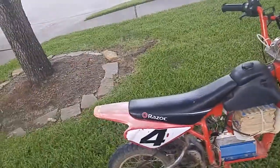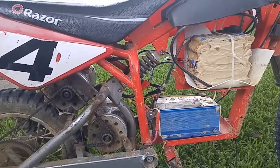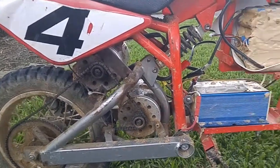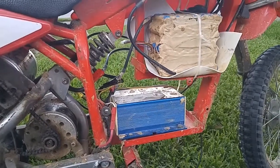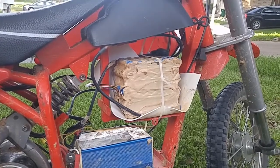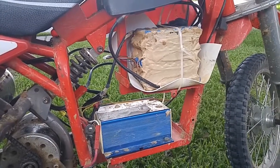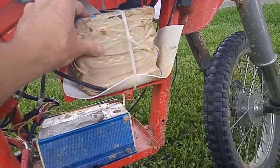Here again is my MX350 that's been slightly modified. I've got two 750 watt motors back there. I've got an Ultrex 300 amp controller set to 150 amps max. I've got 49 times 2 — that's 98 batteries. Those are Tesla cells, painted in a rubber-like epoxy just to hold them.